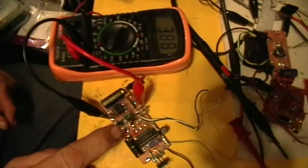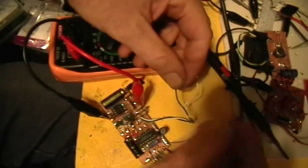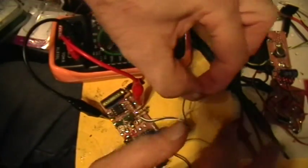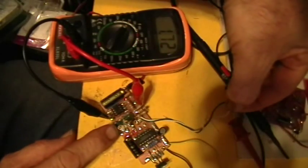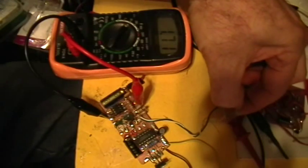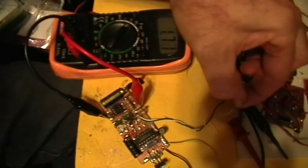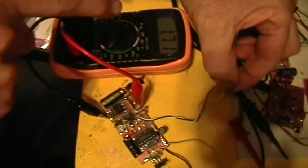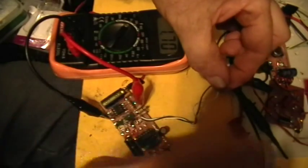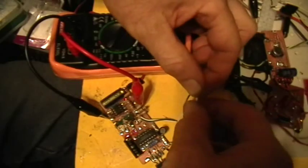I can see the LEDs there. If I take the two wires that go to the 27 millihenry inductor and I simply short them together, you can see that the LEDs don't come on, and the supply voltage drops to 1.72 volts. I'm on a current limiting power supply and the current limit is set to 225 milliamps. So right now at 1.71 volts in, the LEDs aren't coming on with this simply shorted.